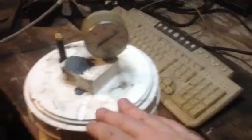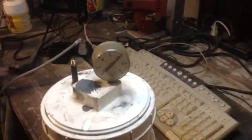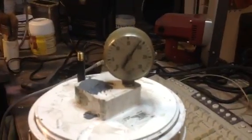My old one that I made actually had a clear acrylic window here, and as soon as you hit the pressure — as soon as it gets to about 15 PSI — you see all the bubbles come to the top, and now it's going to hold this. It'll hold pressure. I like 12 PSI. It'll hold for about 15 to 20 minutes, which is plenty.